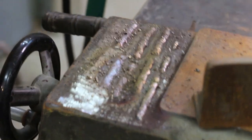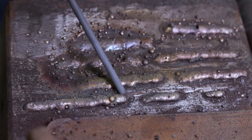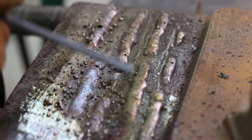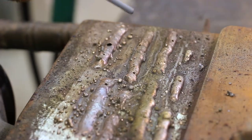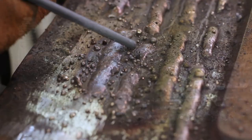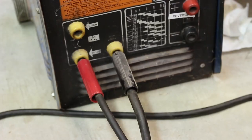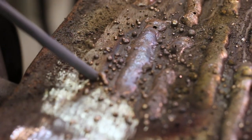I'm going to show you what we learned from our test beads — and I'm glad we did them. On these first few beads we ran on DC, they look pretty good and spatter is minimal, but they just didn't tie in. I maxed the welder all the way to 150 amps on DC and still wasn't getting good penetration. So I tried it on AC at 150 amps and we almost blew a hole through this quarter-inch thick cast iron. We settled on AC at under 100 amps, and look at how much better that weld ties in — though there is more spatter.